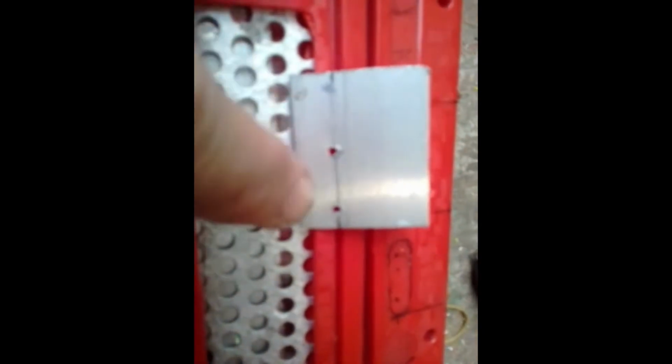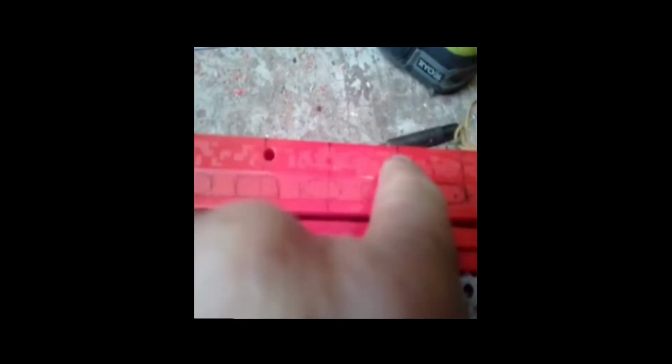Brilliant plan time. So what I've done, got a piece of L profile aluminium. Drill 2 holes in it. They're 1.5. So there's 0.5 over each end, which is, I hope, what size the drill is. Then what I've done is marked every 3.5 centimetres long here. So what I intend to do is put that on there, hold it flush with the top, at the mark, drill 2 holes through the aluminium.